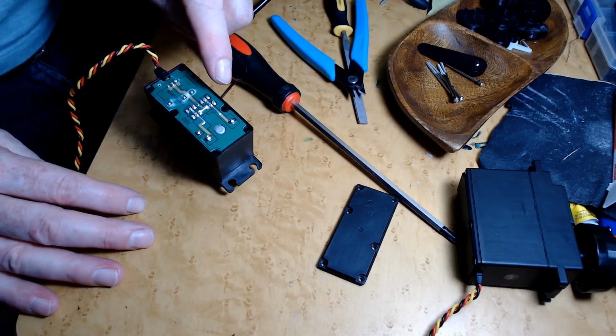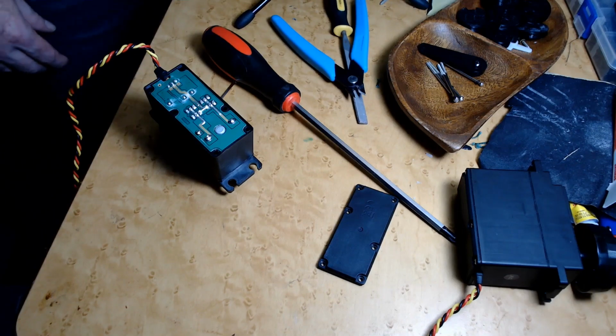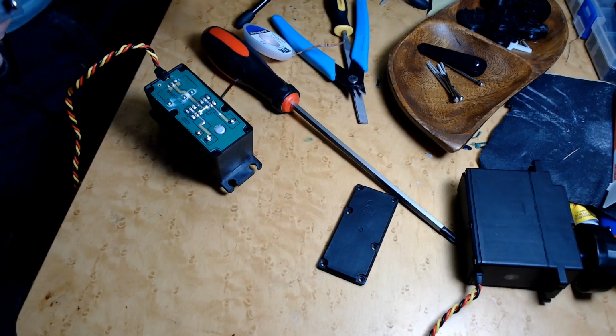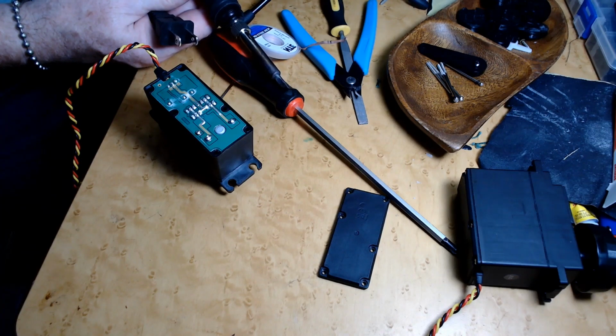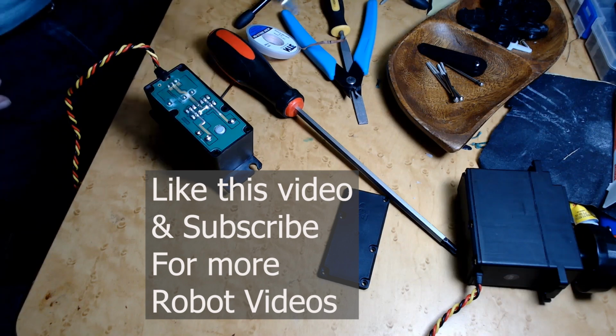The trick now is going to be to desolder these 2 connections. And I'm not sure that I have exactly what I need here. Let me see. Yeah, I might. I've got some desoldering wick I can probably use for that. And I have this soldering tool which has a temperature control on it. I don't know how accurate it is, but it should work. So let me take a break and set some of this stuff up, and I'll be back and we'll take care of desoldering those points. All right.